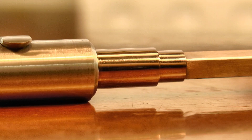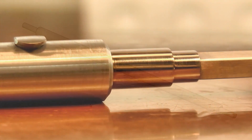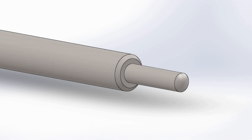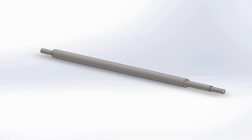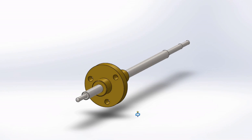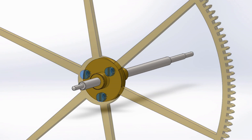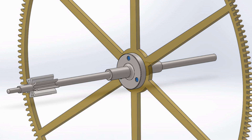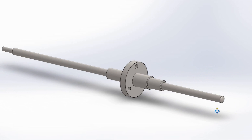This barrel arbor, completed in a previous video, is a special type of arbor. The rest of the arbors are long and thin, usually with a thin pin-like extension at each end called a pivot, which rotates in the clock frame. The wheels are mounted on these arbors using what clockmakers call a collet — basically a mounting flange with a hole through the middle. There's a raised boss section that locates the wheel by its bore, and screws are used to fasten the wheel in place. The center wheel collet is a little different in that it has a pivot built into its profile.